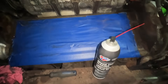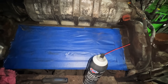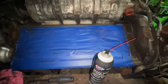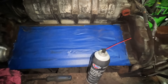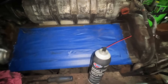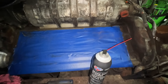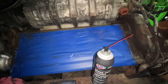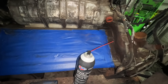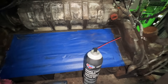The owner is going to do a full rebuild on this. We're going to pull all the liners anyway and replace the O-rings — it's a wet liner, so the O-rings between the coolant passages and the airbox. The labor cost isn't really any different than putting new kits in. We're automatically replacing the one hole that had the water, rusty piston, and gouges, but it's going to be a full rebuild — all new pistons, rings, liners, and bearings. The cam looks good, so we're doing a standard in-frame rebuild, deep cleaning the cooling passages, pulling the water pump and replacing it, and replacing the thermostats.